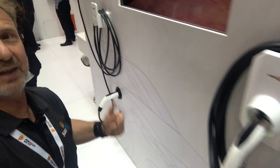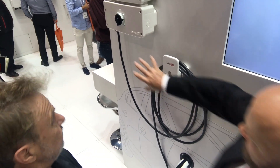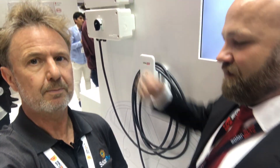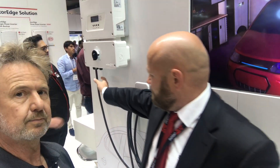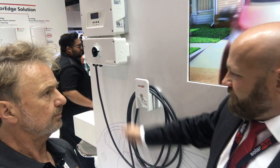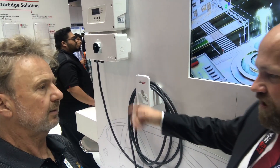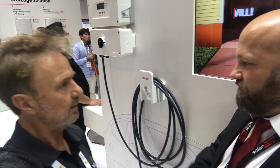So let's have a look at the integrated system. This is our EV charging inverter, as opposed to a standalone. The component inside the DCD on this inverter is actually the same components inside our standalone. The inverter with EV charging built in — you can get it with a plug-in cable. So you can buy the inverter, stick it on the wall, and your customer may not have an EV at this stage, or they can upgrade it later — just plug in a cable. Still an AC output, so they're both AC coupled, and the chargers are AC coupled to the installation. It can still export energy to the grid or to the home installation, but it can optimise energy to your car — so instead of exporting energy, you can charge your car directly.